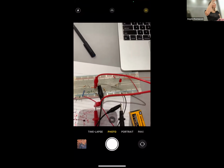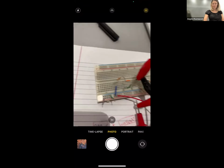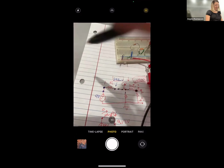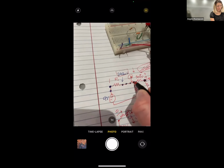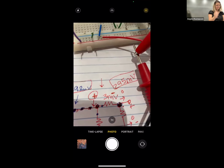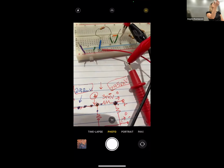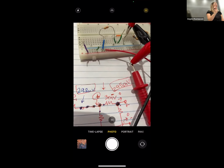And so whenever you see a voltage difference, if you don't see a difference and you see just a node, that means I'm going to be at, for example, we had it here, and that's always going to be compared to ground. So anywhere in a circuit, a node is compared to ground, unless you see the plus side and the negative side, which in this case, we had the plus on this side of the resistor and the minus on the other. So then it's the difference of whatever voltages are there. Does that make sense? Okay, so those three concepts, make sure that you do understand.